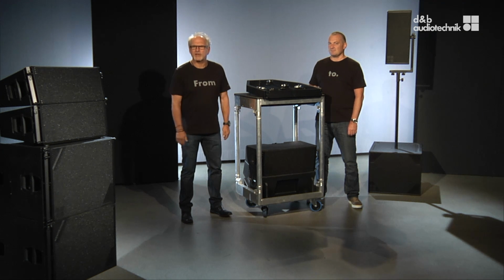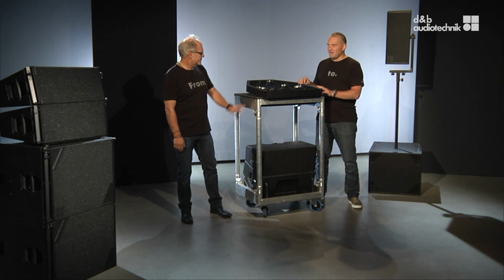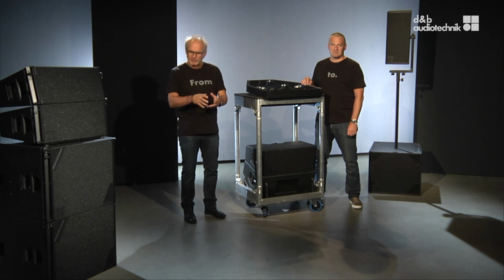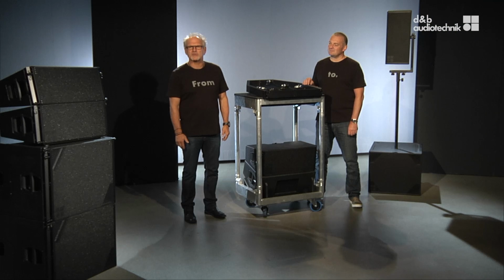The Y-series line array accessory overview. From the proven D&B 3-point rigging system as known from J and V series, and the Y flying frame for up to 24 tops or subs on top of the array, the fully integrated rigging system to the vertical setup workflow. Other accessories range from flying adapter for 6 tops, a base plate with an M20 for ground stacking, installation mounting frames similar to the VI series, transport lids for subwoofers, to a selection of transport carts and cases which complete the entire Y-series system package.